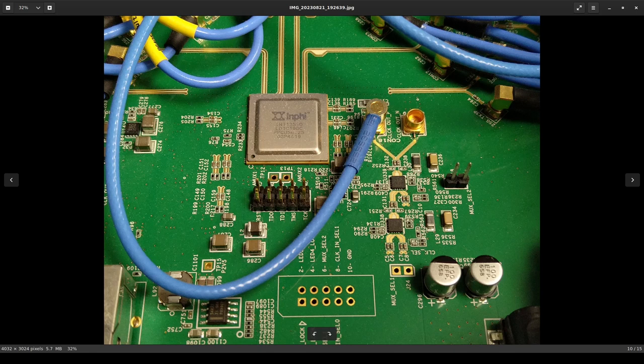This is transmit channel 3. We can see AC coupling capacitors on either side of the differential pair going out towards the coaxial connectors. Down on the right is the reference clock output muxing — a fully differential mux. There is a differential version of the output reference clock, but it's not pinned out to the front panel. The positive channel is connected, but there's a floated connector, so it would probably not be too difficult to get a differential reference clock out of this instrument.